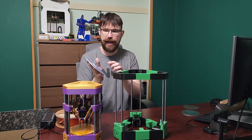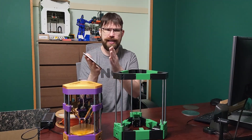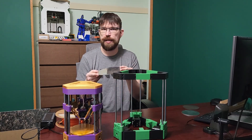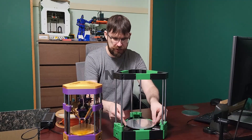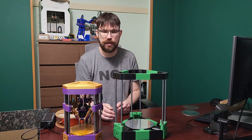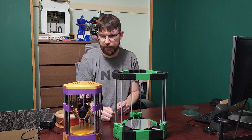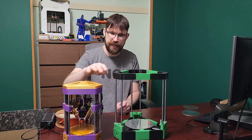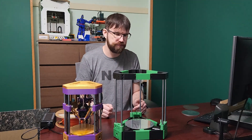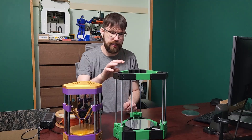I do have a 120mm 24V heater that will go onto this bed — it's about $15. This is going to be a great bed for ABS. You can see how much nicer the 150mm bed is proportional to the frame. I might get a 140mm printable area on this. I don't quite know about height yet, but I have increased the frame height by 50mm from Min. We'll see what that works out to. That's a look at the 150mm bed that is on Delta Flyer.